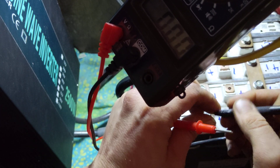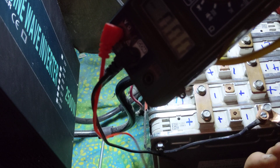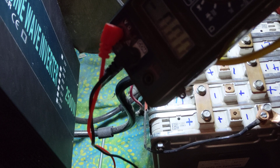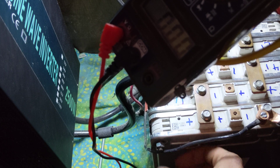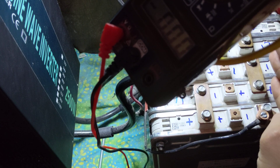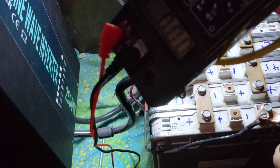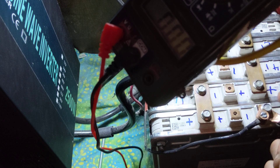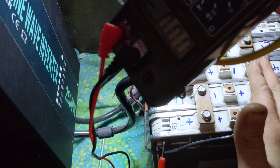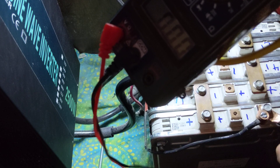These two are the same used capacity. My system is very unique in that I've got four different capacity voltages after they were pulled out of the car — they come stamped with that information before shipping. It's because of that that I have four different voltages: when I first bought these things over two years ago before I started this project, I was inexperienced and naive and didn't realize that was the worst possible idea. I ended up with four different voltages because they came at four different times and out of four different cars. I should have ordered all six modules at the same time so they'd all come out of the same car at the same voltage.